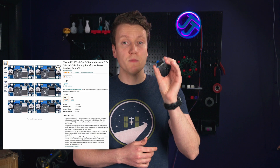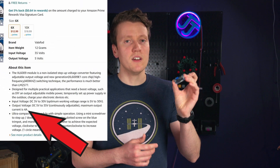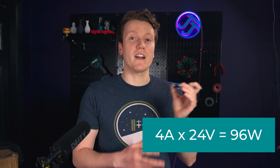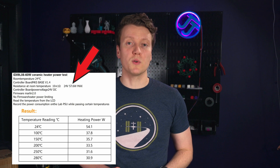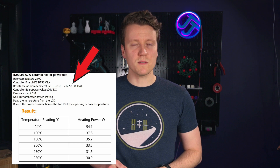It all made more sense once I realized the voltage booster was only giving about 13V to the hotend. This component was rated at 4 amps output — 4 amps at 24V should be about 100 watts, and the CHC hotend listing says it only goes up to about 56 watts max. So in theory this should be adequate, but in all my testing this week it just doesn't work. Do not use this on a 12V system. Maybe in the future I'll revisit it on a 24V system, but as advertised and as purchased, stay away from this product.